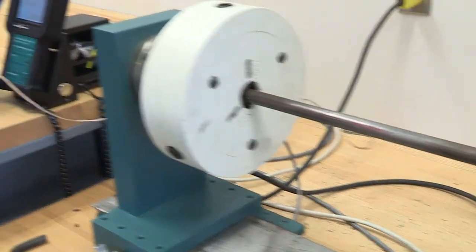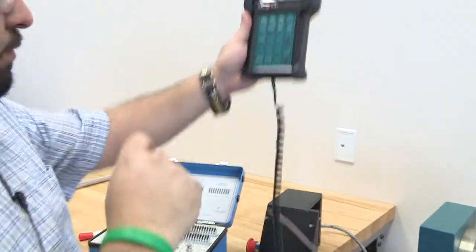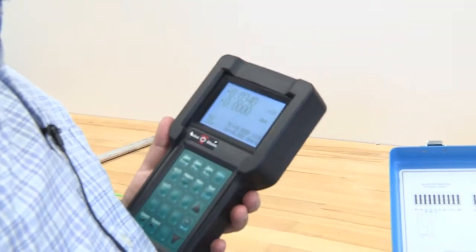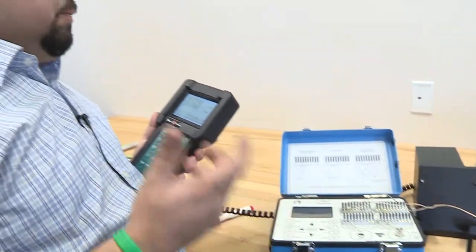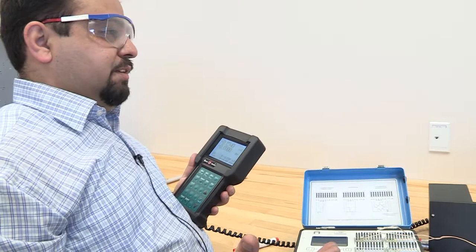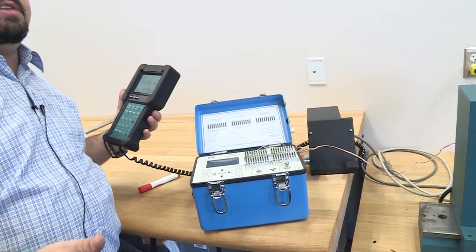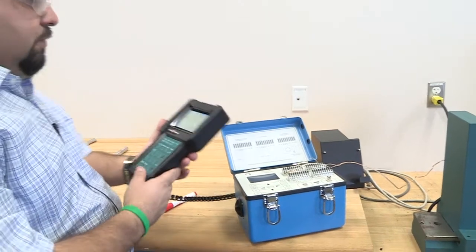Now we are going to start the test. The way this works is really easy: I'm going to apply torque and load it all the way to 5 or 10 degrees, stop, and read the torque and the strain. You can do 5-degree increments or 10-degree increments. I prefer for aluminum to do 5-degree increments for the first 10 or 15, then switch to 10, then even to 20. For steel, I mostly do 10-degree increments for 10 increments, then switch to 20, and later even to 50, if you have the plastic section.